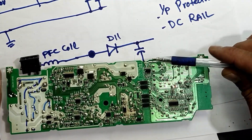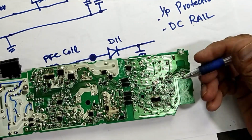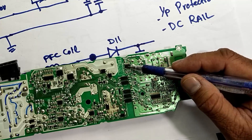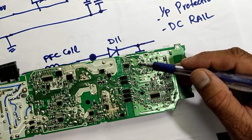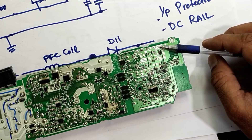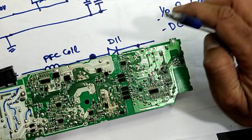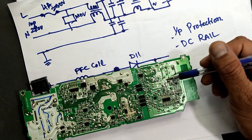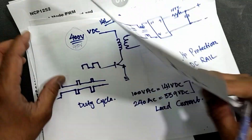This transformer will switch and we will take AC voltage in the secondary. This circuit is much different than other circuits because in the output stage it also has MOSFETs and we have a synchronous rectifier circuit — the MP6922 — that controls the switching. This IC will switch these MOSFETs and we will find rectified voltage. This controlled rectification is used for a regulated voltage in the secondary section. Primary is regulated by PFC, and the secondary voltage will be regulated by the IC MP6922.